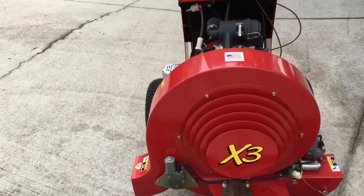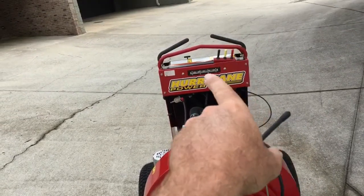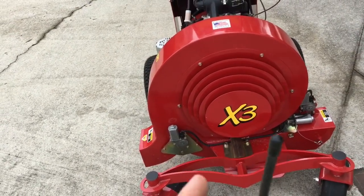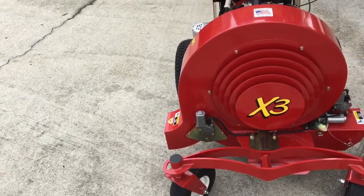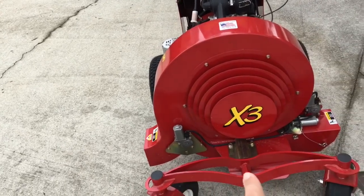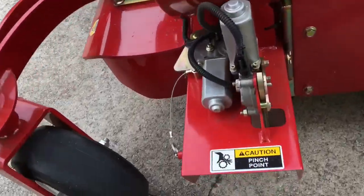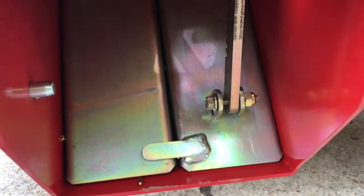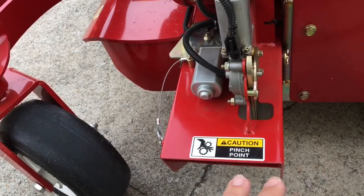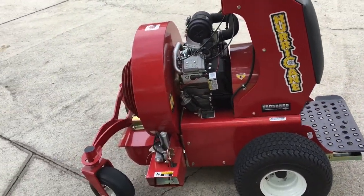What's unique about the Hurricane — and I've told you guys before — is that it shoots air in three directions: off the front and off the side. That's what those three buttons control. The front one pitches up to the right just a smidge, so if you're doing a sidewalk it's at a shallow angle, not dead straight. You can only really open one chute at a time. The buttons adjust the fins inside up and down so you can get right up to a curb and pitch it out, or get five or six feet away from the curb for the full effect.